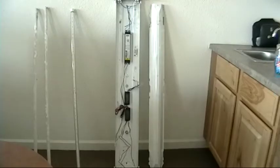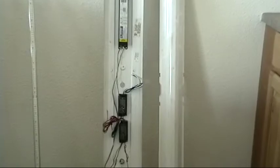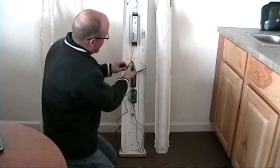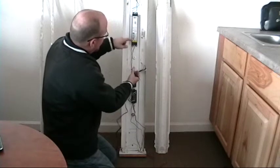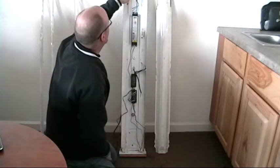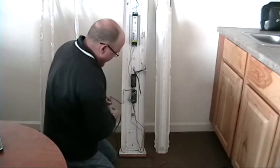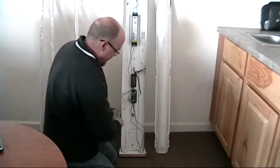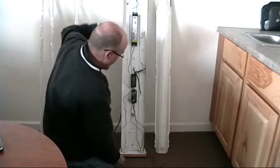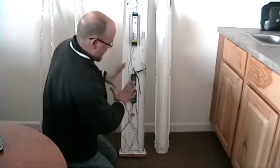Here I've just mounted the two drivers inside. Normally you have your white and your black running into the power, running into your transformer. The transformer has a single red going down that jumps these two blues, and then two blues — one goes to one side and one goes to the other. Each driver is for each bulb and has a red and a black output. It doesn't matter which end goes to which. You just get the black wire down to this side and the red one up to this side. Same thing on the other driver. Then put the cover back on — done.